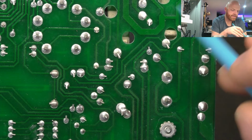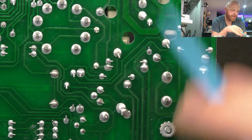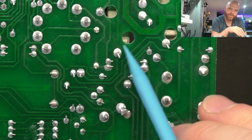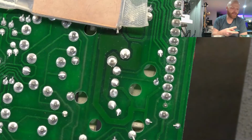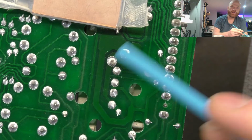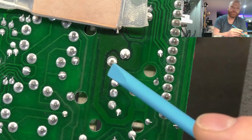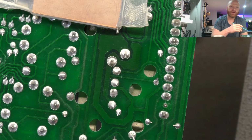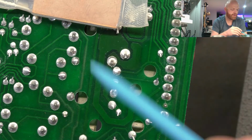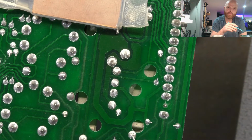Heat accelerates it. So if it's connected to a component that's dissipating a fair bit of heat, they're usually the solder joints that degrade the quickest. And you can see there's a bit of board discoloration in that area, showing that the board's been affected too by the heat on the other side. Ideally, they probably should have been lifted off the board a bit further. Or if you want to be real keen, mount them to a chassis and run wires to them so that the chassis acts as a heat sink. But again, almost nobody does that.